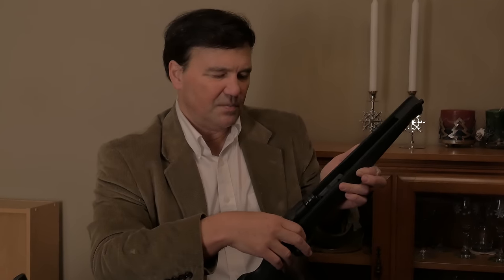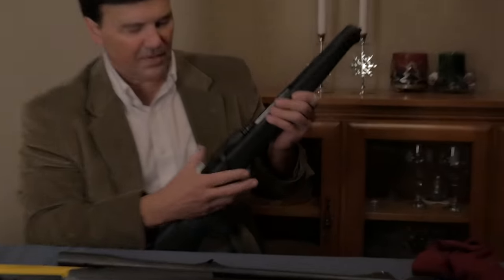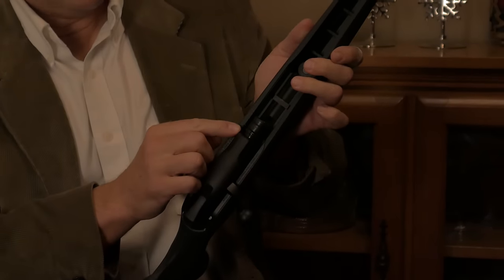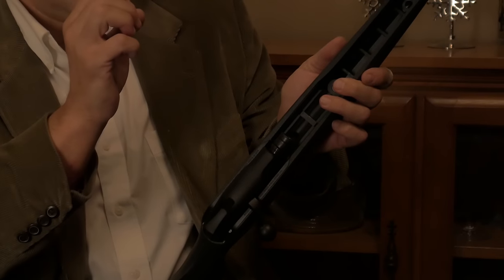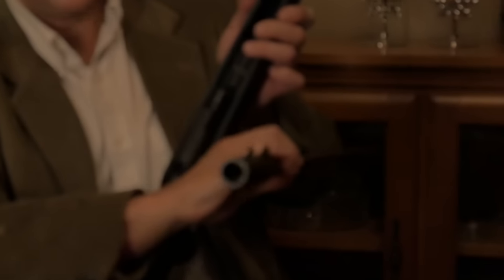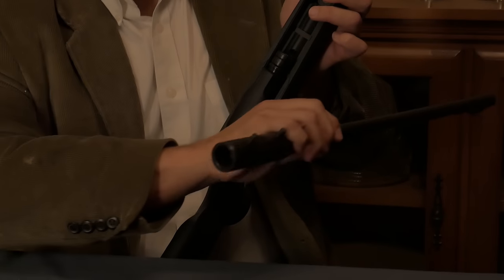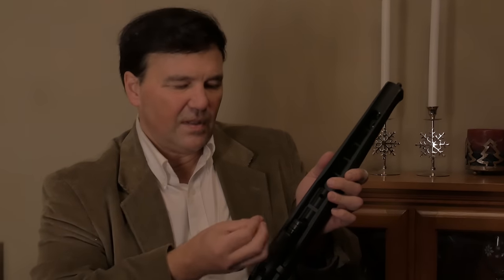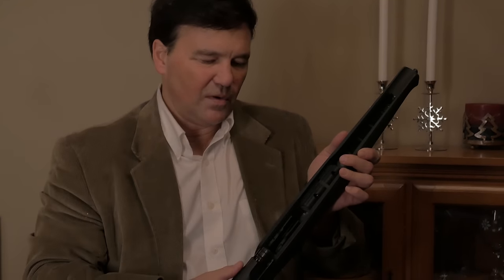The viewers are pretty educated with guns. My point is: when you pull this handle back, you are actually moving what amounts to a bunch of petals, for lack of a better word. Those petals are fit into the back of the chamber of the barrel. You won't see these things, but if you go to your gun store and look at it, you'll figure it out. They fold in, and when they fold in the bolt can move backwards very quickly.